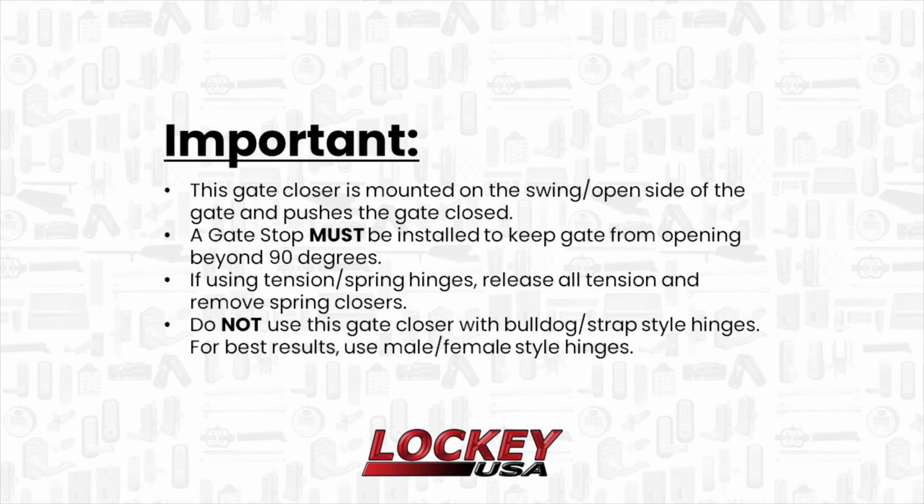This gate closer mounts on the swing or open side of the gate and pushes the gate closed. A gate stop must be installed to keep the gate from opening beyond 90 degrees. If you are using tension or spring-loaded hinges, release all tension and remove the spring closers. Do not use this gate closer with bulldog/strap style hinges. For best results, you will want to use male/female style hinges.